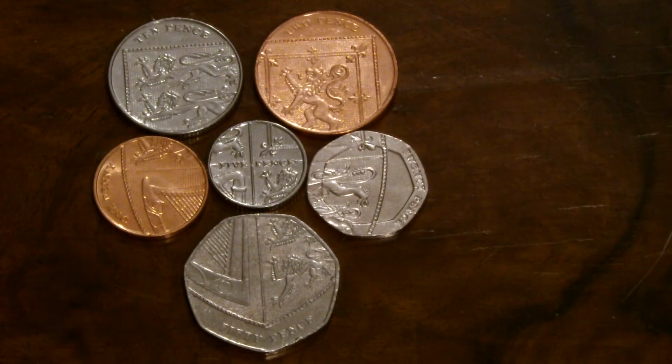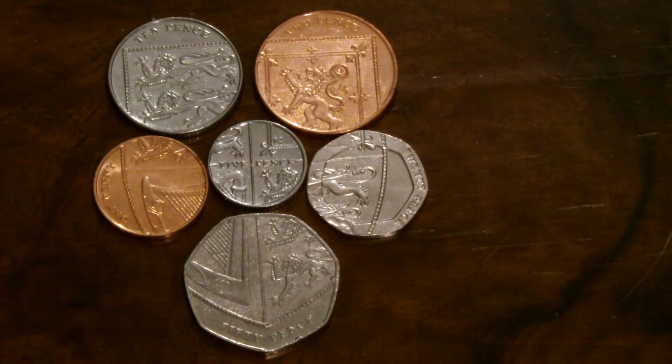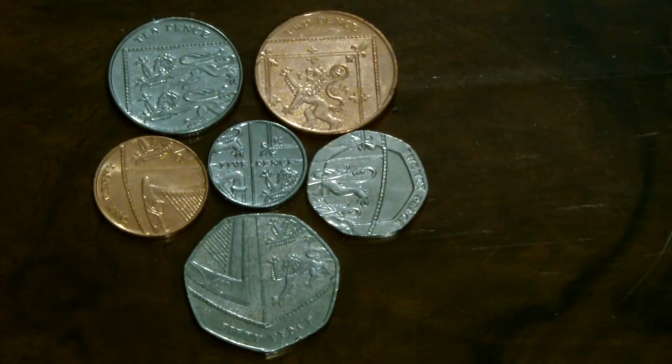So metals are actually crystalline solids. People don't realise this because of their relative malleability and ductility, but there are basically crystal lattices at work in there. And so if you work a metal, if you bend it, you twist it, you reshape it, what you're doing is you're introducing stresses internally, because the crystal wants to be a certain way, and you have made it be a different way, and that kind of breaks bonds, strains bonds. And so what that means is that you're actually using up that natural margin of malleability that you have.